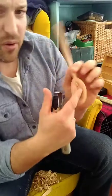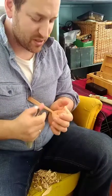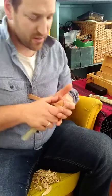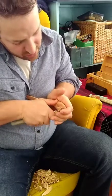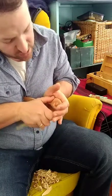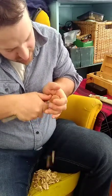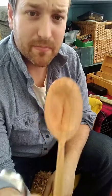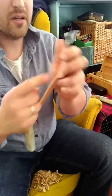The way the grain is tilted in the bowl makes sense for me to come down the bowl this way, then turn it around, put it against my sternum, support it there, keep my hand out of the way — bracing with the back of my thumb — and do similar hogging-out cuts opening and closing my hand to get the middle of the bowl. The goal is removing the bulk of material in the center while staying away from the edges.